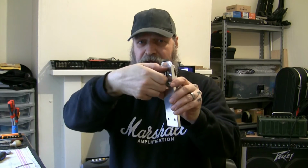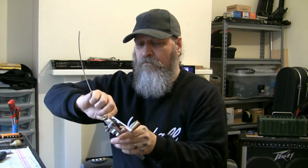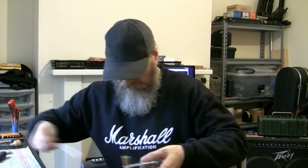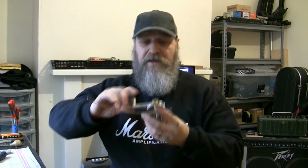What I'm going to do is undo the back. I'm going to turn this one quarter turn, loosen it, and that's pushed this wheel a little bit closer down there. It means I'm going to get a slightly bigger bend. There you go. Beautiful. And that's what I'm going to do with all this. Slightly bigger radius, it means I'm going to go a little bit tighter. And we'll be just over 12 there, absolutely fine. It means when I put the edges in, the top's going to be sticking proud of it. Then I'll get it in the press and we'll press it in.